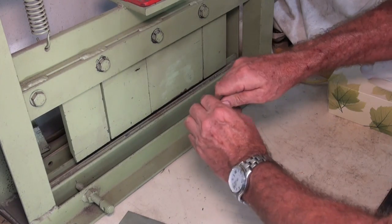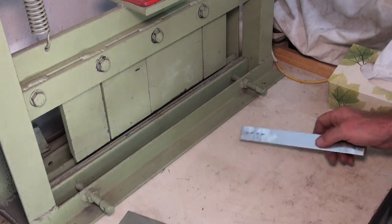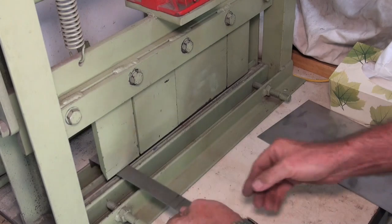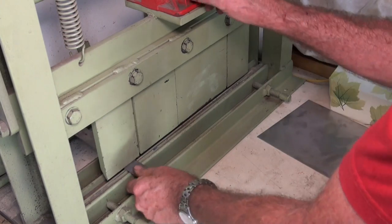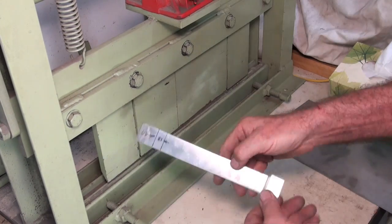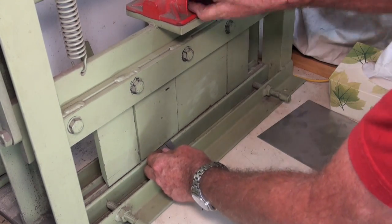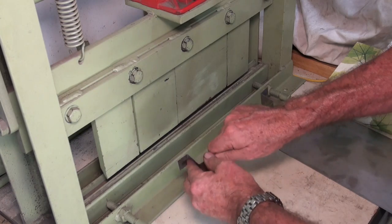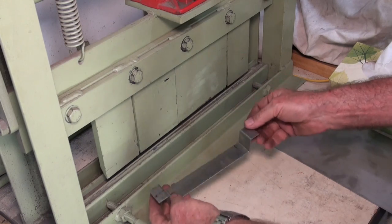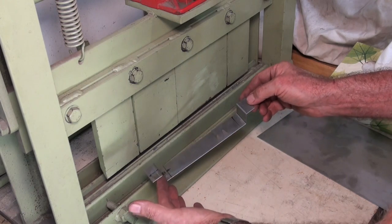Overcooked that one a bit. So to get the last one, I'm still going to have to turn that back to front, I think. There you go. Now you can see why I didn't bolt the machine down. Okay, so there's our two Z brackets. Pretty good. So I'm just going to cut this off now, and we'll get this spot welded onto the plates before we TIG weld those to the rest of the burner.